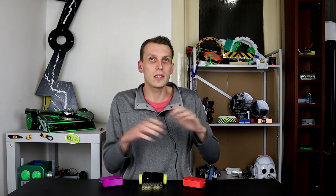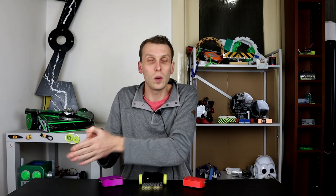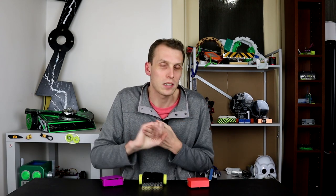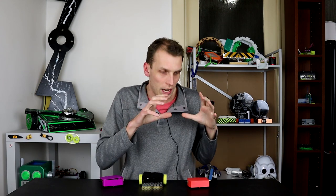So today I have taken a 30-to-1, a 50-to-1, and a 75-to-1 set of motors, built them into some little test platforms, and we're going to test straight-line speed, pushing force through the motors and through the robot, and also repeatability of turning — because being able to hit the same point when you spin around really fast is quite important for getting to a certain angle to run away, run towards someone, or deal damage.